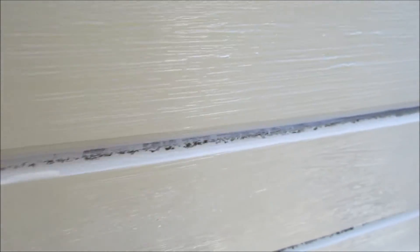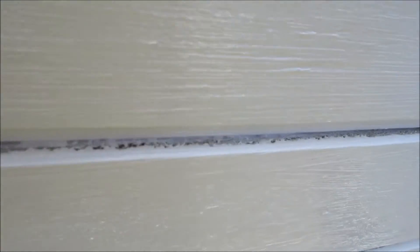As you can see the channels on this side are not painted nearly as nice. The paint is really hard to get inside there — that's why you've got to spray it at an angle in quick bursts so you don't get too much paint in there.